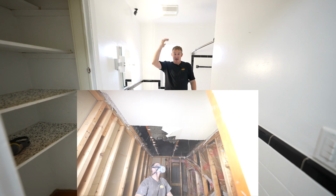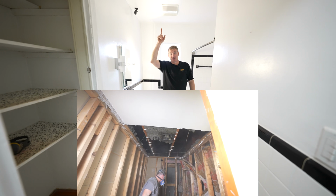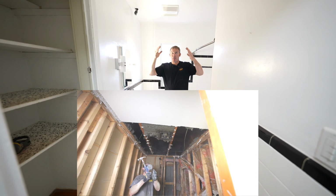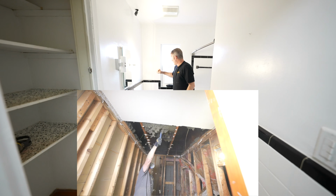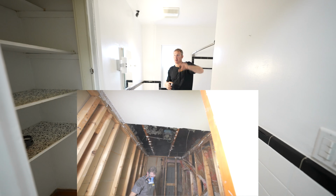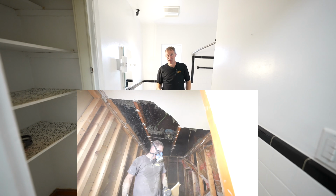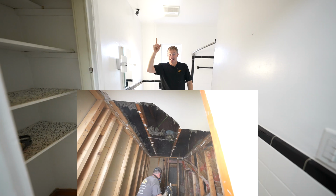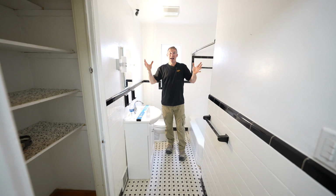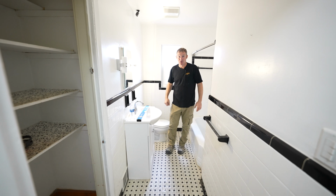And a lot of times people would do blown-in insulation in their attic space above. You could probably evaluate that if you had access to get there, but I would just plan on putting insulation in your outside wall and having all new insulation up here. But just know that when you remove the ceiling, if it's blown-in insulation, it's definitely going to be a messy, dusty situation. But really, you have to evaluate or plan on putting new insulation in a bathroom that's this old.